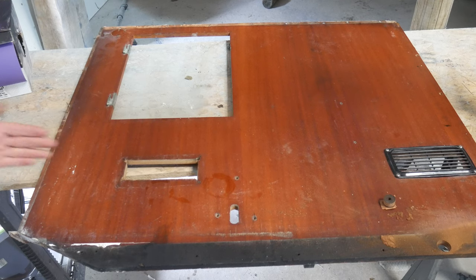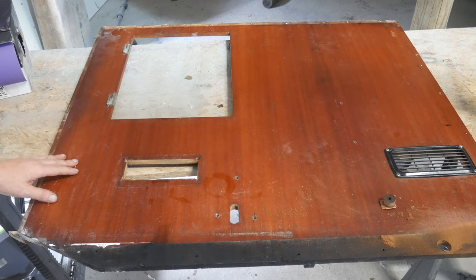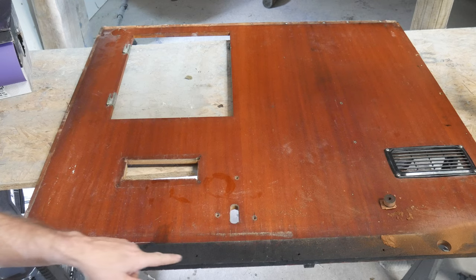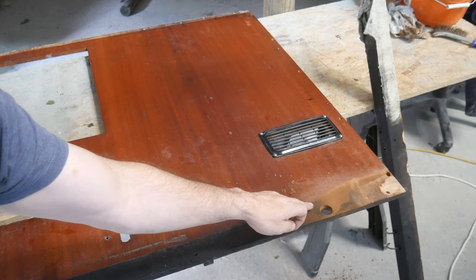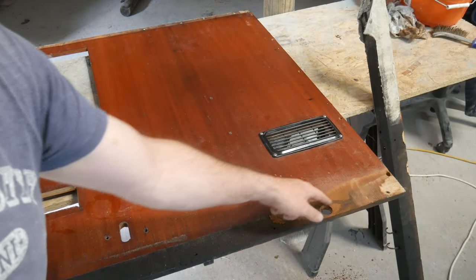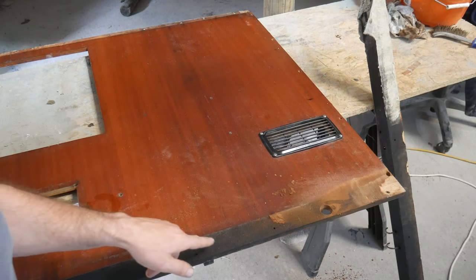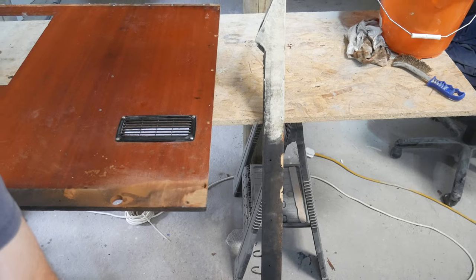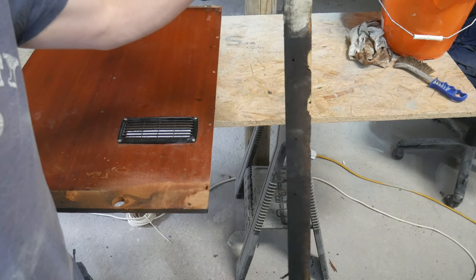I'll start by showing you some of this timber I pulled out so you can see what condition it was in. This is the main panel that was at the front of the galley underneath the companionway steps - the good thing about removing it is the bottom was saturated with that black gunk, which it was just wicking up. I've done a test to see how much I need to sand back to get to good dry wood, and it needs about a millimetre and a half of sanding. The other piece I'm quite happy to see the back of is this sole bearer - I can replace this with a nice dry one.